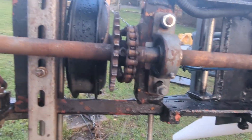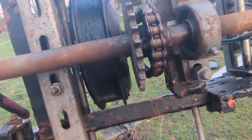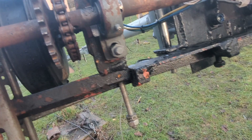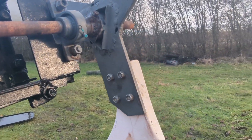One thing I actually want to try — I'll just show you this a sec. If I give the blade a quick spin, you can see it turns very easily; it doesn't require hardly any force. What I'm going to do is connect the dump load — heater dump load — to the rectifier, and then we'll come back and try again.